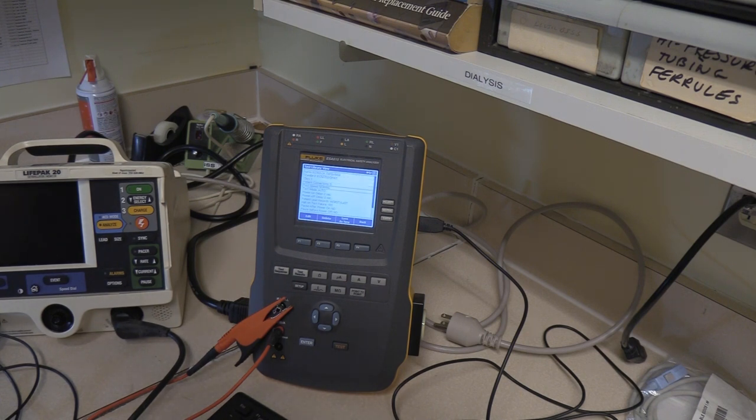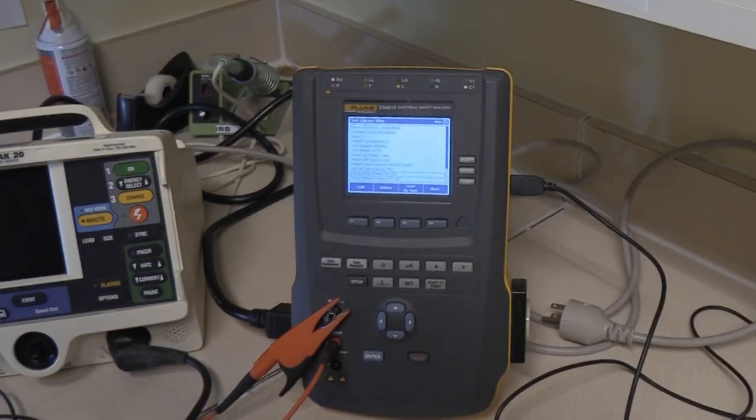Five patient connections — all good. Right here is one we might want to change: pause after power on is set to no. I'm going to change that to yes. I'll hit F1 to edit it and now we're going to start back over from the beginning, making sure we keep everything the same. The 62353 direct — that's correct — so we're going to hit next step.